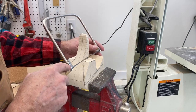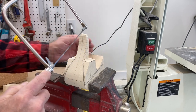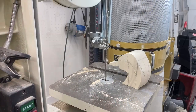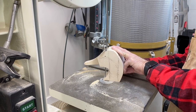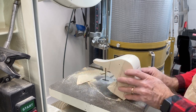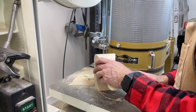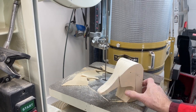Since this next cut is pretty deep, it's going to take a little while with a coping saw, but I'm comfortable with this head shape so I'll use the band saw to remove material on both sides, front and back. The video is sped up here — keeping my fingers out of the way and using those guidelines, carefully removing wood from both sides, then doing the same thing on the back. You don't want a sharp edge on the back of the neck, so leave some material back there — but you can see the head is starting to shape up.